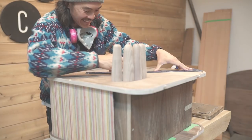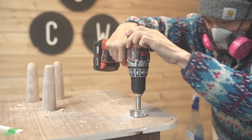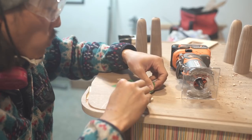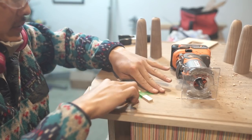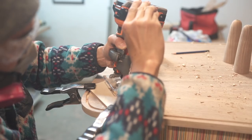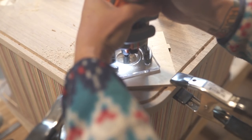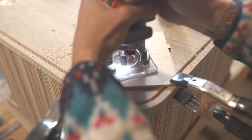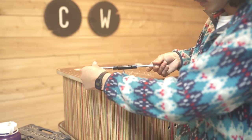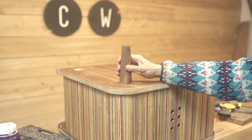We then turned back to the box and how the legs attach. We used a pencil to mark the center point and the approximate angles we'd want the legs splayed to — essentially towards the corners. Using a Forstner bit, we cut out a rough two-inch circle for where the leg would sit. Then using a trim router, we built a jig knowing that going down about three-eighths of an inch would give us approximately a 10-degree angle. We used the trim router solely within the Forstner bit circle to give us the angle for attaching the leg. Once routed, we drilled a five-sixteenths hole and tapped it to receive a three-eighth inch thread, and threaded in the legs — I also used a bit of epoxy, so they're rock solid.